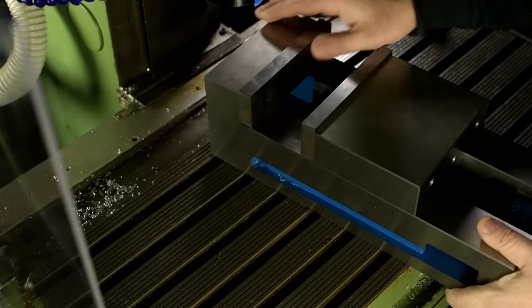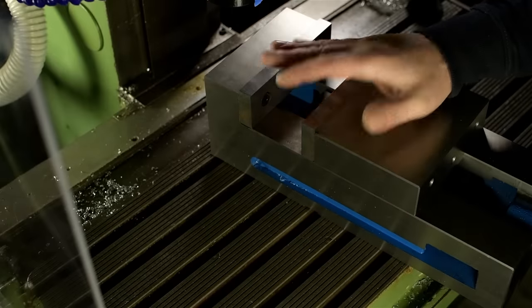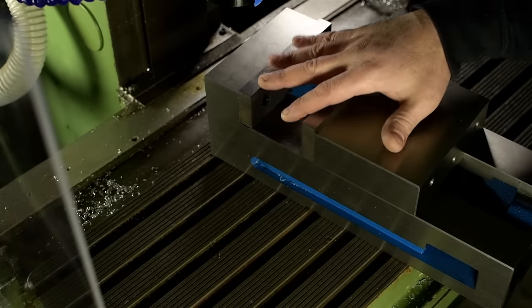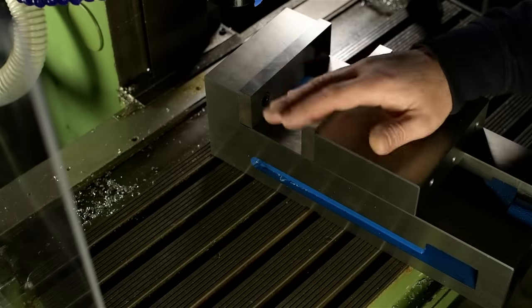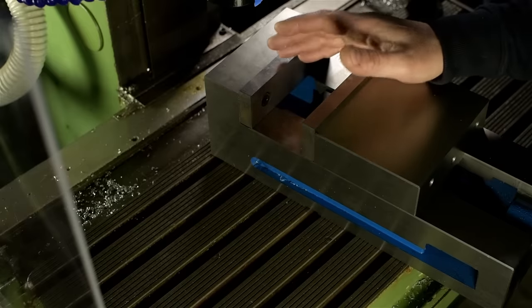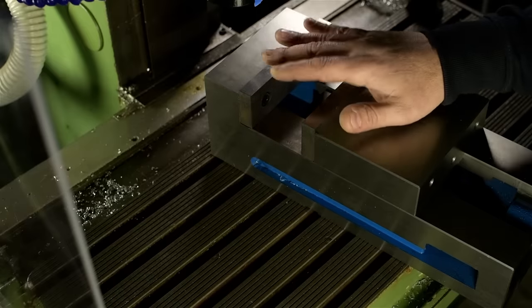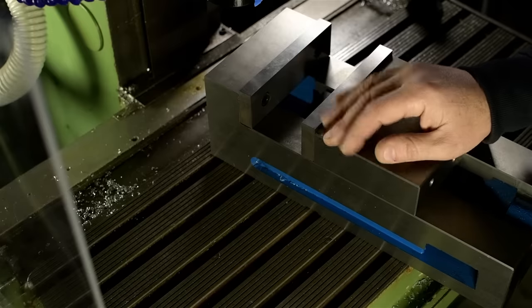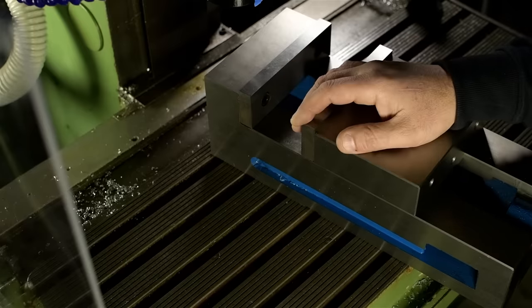Holy smokes, this thing is gigantic. If you buy the big name brands, spend the cash, you can get matched vises, meaning their height or dimensions from the bed is identical, or to within some crazy small tolerance. But if you have 2 or more vises, it probably pays that they be exactly the same. With these lower cost imports, odds of that happening are probably pretty slim, I'd guess. Though they do spec a height tolerance, so who knows.